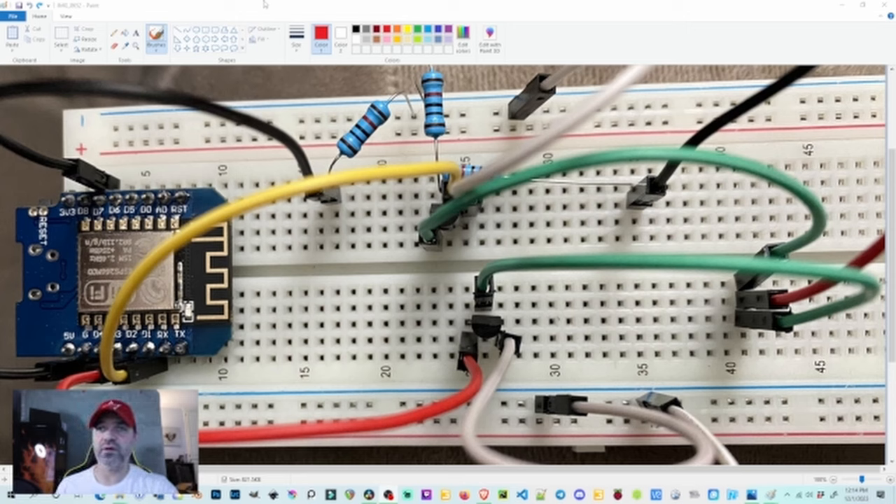I copied the breadboard from the rat-gdo project on GitHub. I've got it pulled up on my screen right here. I want to go over it very quickly, and then go over my own board, so everybody can understand how things work. Even if you don't have a great understanding of electronics and these chips, you can still do this yourself — you really can, even if you've never done it before. The soldering part you'll want to practice before you do it on these more sensitive components, but it's definitely something a beginner could do.